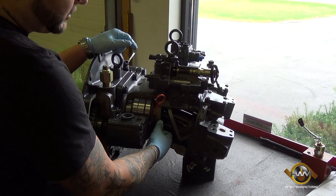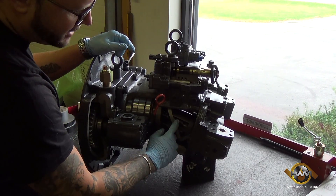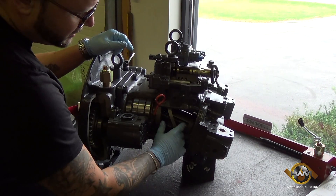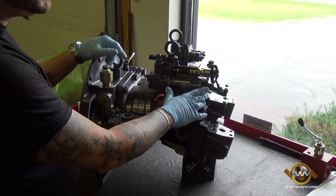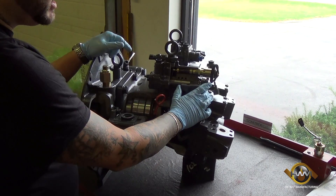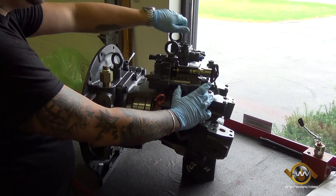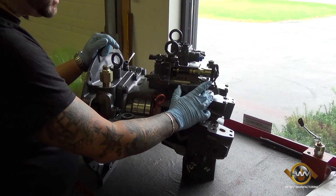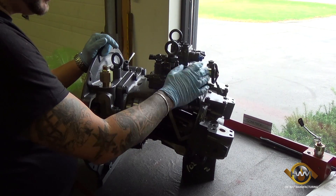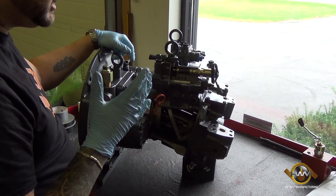Inside here you have a horseshoe that begins and creates the swashing. You have your swash plates and main body housing. This cutaway has been recessed and milled down so you can see the actual plungers or shoes for the rotary groups. This is a sensor-loaded regulator valve. Over here we have an EPR — an electronic sensor or solenoid — that helps function and regulate the pump's pressure. There are main springs in here to load and operate with the computer so it functions properly on your machine. All of this has to come in unison to give you that essential power you're looking for.